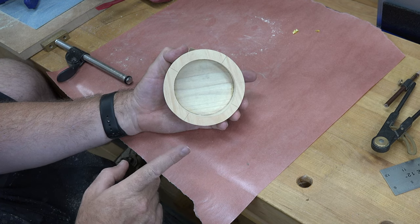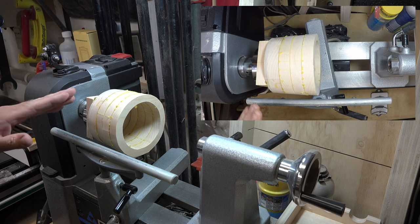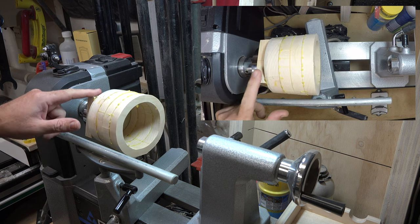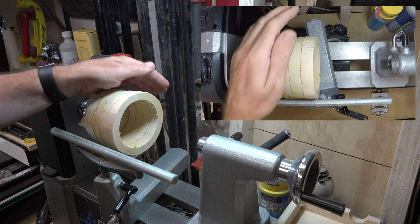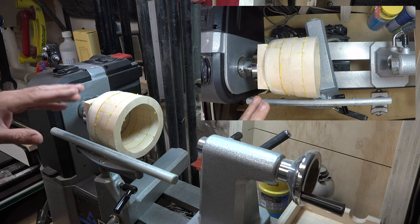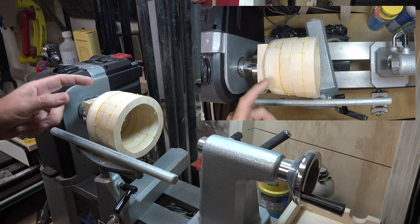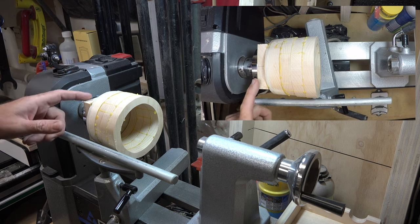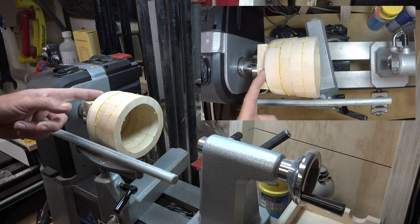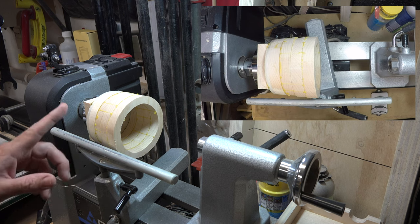Once that is dry we can glue our three rings on top of our bowl, clamp everything together, and let it dry overnight. It's the next day and all the glue is dried. I've mounted this to the lathe using a face plate on that three-by-three square of pine. I don't expect this to turn true — it's going to be a little wonky. The very first thing we're going to do is level this out. Remember that craft paper glued between the two layers is designed to help you break this free later, so if you get a catch it will break it free. Take light passes and let's get the outside leveled out and turning true.